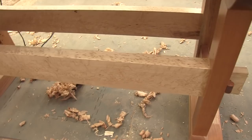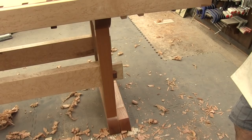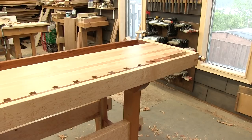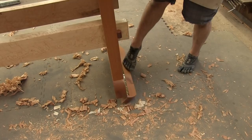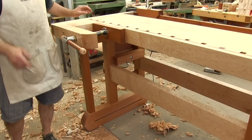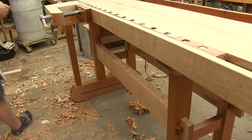These were done in maple and then I wrapped them in bird's eye — bird's eye glued to the top, to the front, and to the inside edge. Now let me show you this: the friend I built this for wanted a bench that gave him two heights. When you're planing, it's nice to be over top of the wood so you can lean over it and put pressure on the plane. However, when you're cutting dovetails — particularly as you get older — it's nice to have it at a height where you don't have to bend over. The easiest way I could come up with to adjust this was to simply hinge another set of feet. You lift the bench up, that foot folds underneath, go to the other end and do the same thing. You gain three or four inches — depending on how big you make those, there's really no restriction. Now you're working at a higher level, sawing and chopping at a higher level. It's just a whole lot easier to work.